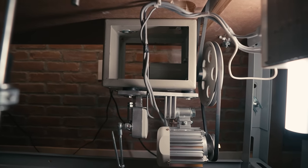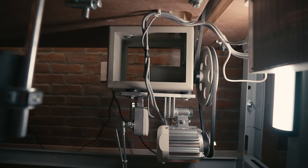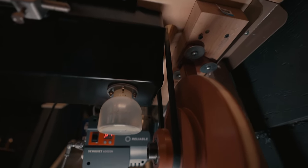With my Adler, I couldn't put the same speed reducer as I do with my Juki without really modifying the table and wrecking everything. The way the belts are in my Adler are different than in my Juki, so I had to use what they call an inline speed reducer. It pretty much does the same job but is configured differently. With an inline speed reducer, the belt, motor, and pulley are all in line. I had to modify my table slightly so the belts would fit properly. They both produce the same end result — just the method of installation is different. But a speed reducer — you're definitely going to need one.